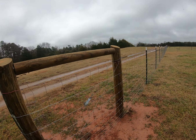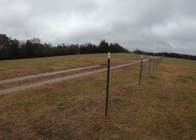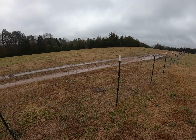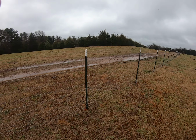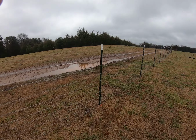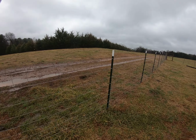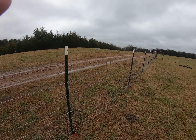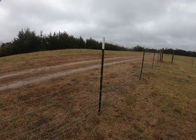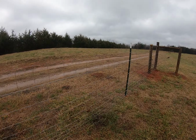So you see, we walk down the line here. Fence is pretty strong. I pulled it really tight. In the past, I pulled my wire here, I didn't put enough pressure on it, and over time, it would loosen up. But this time I really, really pulled it. And that's kind of the reason why I didn't want to pull that last wire last week, because that brace, I didn't want it to move any. I wanted it to harden up real good, because it's down here in this corner, believe it or not, this one brace actually moved a little bit when I pulled the wire.